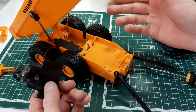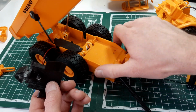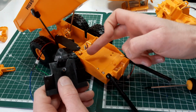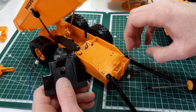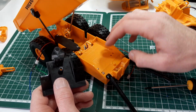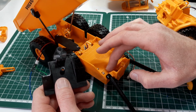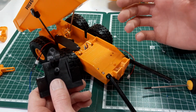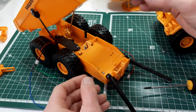It looks like, I forget how this was wired, but it looks like they had ground, probably 3.6 volts and then 4.8 volts, because this is a set of 4 AA batteries. So maybe they were taking power unregulated from 3 of the batteries to power the circuit board, and then the motors were being driven by all 4 batteries, which is okay, but it means that these 3 batteries would discharge slightly faster than the 4th battery up here. But then again, the motors are going to be drawing the majority of the current, so the actual radio circuitry was probably minimal anyway, so probably wasn't that significant.